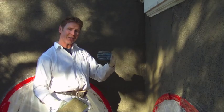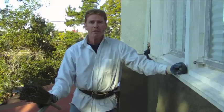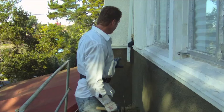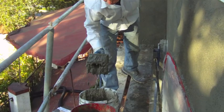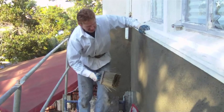I'm still going to come back and dash when I'm completely done. Now that I've got a heavy float finish on here, I've almost got this dash matched — just a little bit more. What I have is a soupier bucket of sand here. I fill this dash brush up and let it drip — see how wet that is — let it drip off, then I just kind of lightly throw it on there.